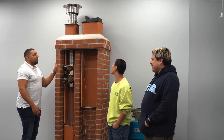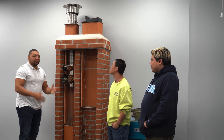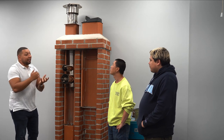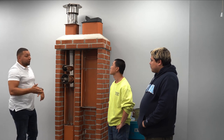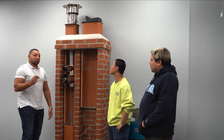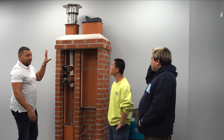You might need a chimney cleaning because your units don't draft properly, and there's a blockage or something happens. The furnace has what's called a barometric damper, so anything that comes back into the pipe the wrong way, it'll cut the unit off. Hot water heaters don't have that, so they're more of a health and safety hazard than a furnace, because the furnace will shut itself off, but the hot water heater won't. So you have a chimney cap on the top there, and that's what that does.